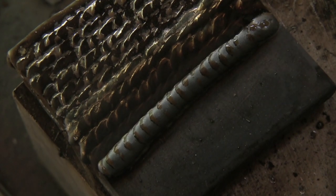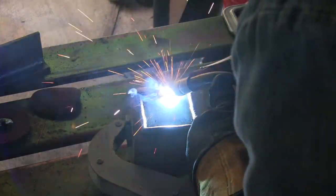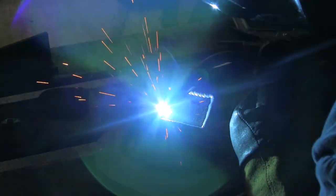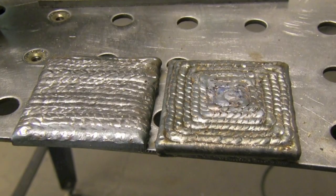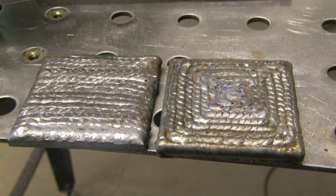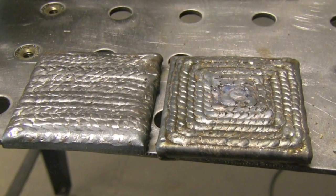Lots and lots of beads with very little time to prep — that aluminum block is pulling the heat out so I haven't even had to dunk this one in the bucket at all, and I'm almost done filling it up with beads. I'm getting a little crooked — that's just another thing to pay attention to: stack beads very intentionally and try to straighten things out as you go. Another version of this drill is to start on the outside and backstep weld, tying into the previous start, filling it up that way. Both versions give you a lot of practice with very little cleaning or prep.